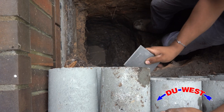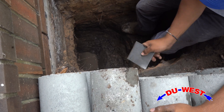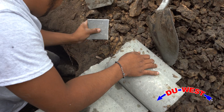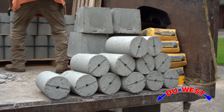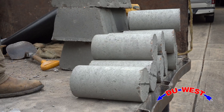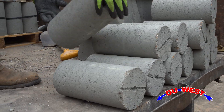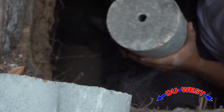The first thing you do is stack your cylinders, and you need to clean the ends of the cylinders off, because when they're cast, you're going to notice there's a little line that goes across, and that line will have debris on it that needs to come off. Those holes down through the center are tapered, so you always want to have the part with the line sticking up so that the taper is going the right way.